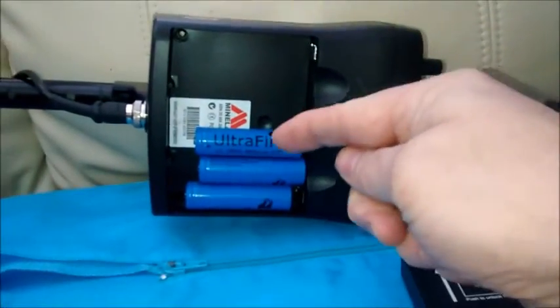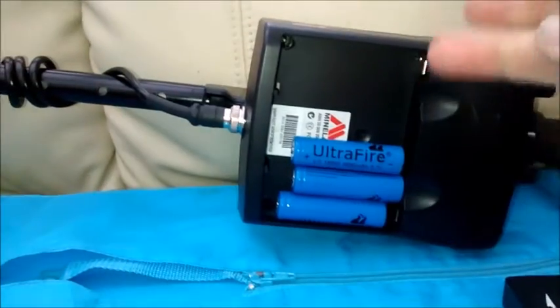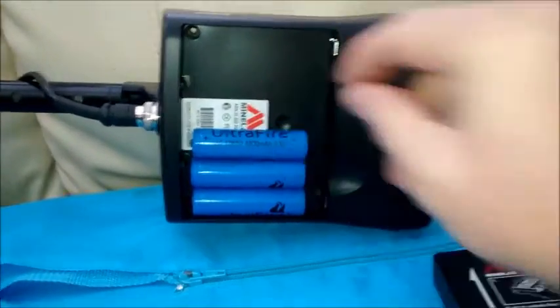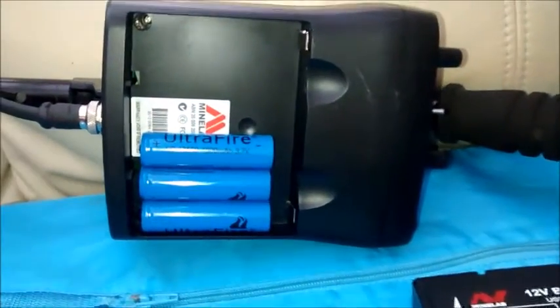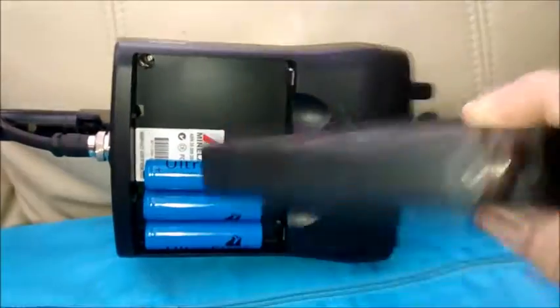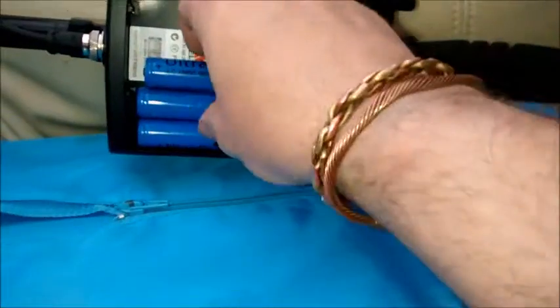Three of them in line gives you 11 volts, so we could have two sets of three. I should have a capacity of about 5000 milliamps. When six of these are made into a pack, I should have about 5600 milliamps approximately. As you know, the pack that comes for this rechargeable is only 1000 milliamps. So that's the plan — that's one option.